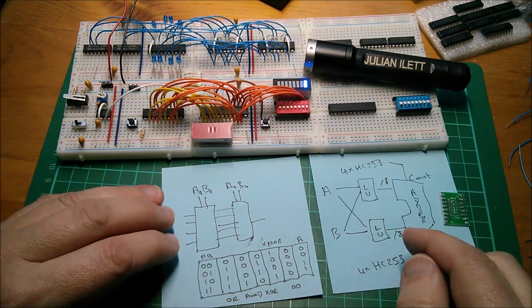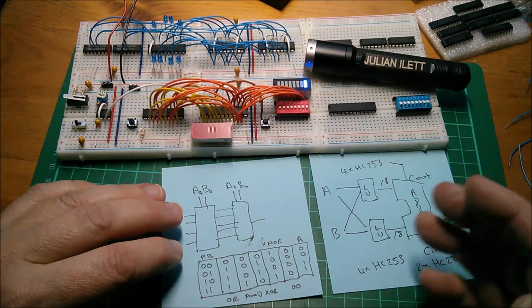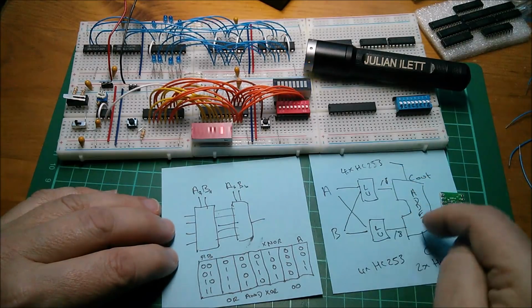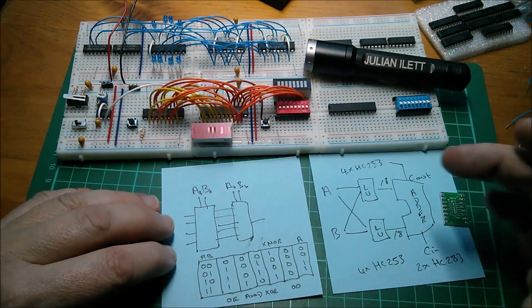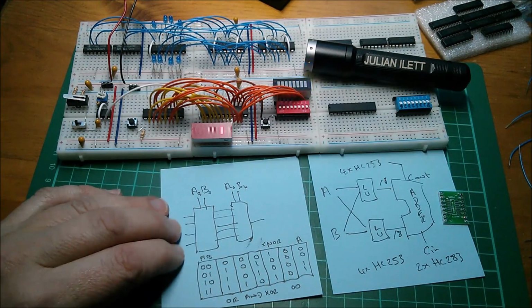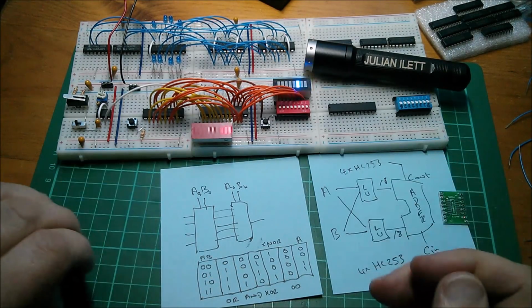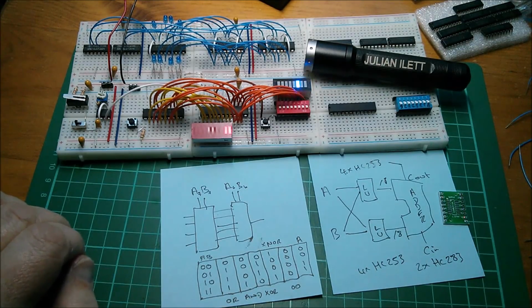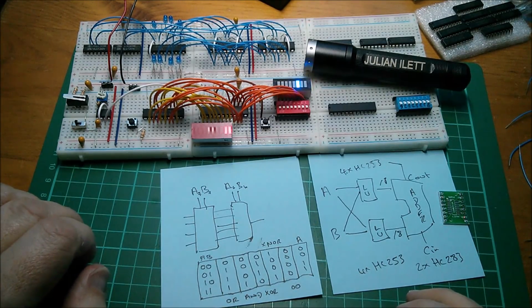And I did think of having one literal, perhaps 0, somewhere on a pre-wired register, and then using the logical unit to create other literals from that. But because I can't configure the logical unit, because I have no literals, I can't use it to create the literals. It's kind of a chicken and egg situation. So I've got to think of another way of creating literals.